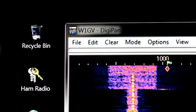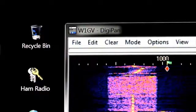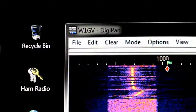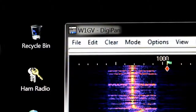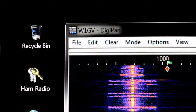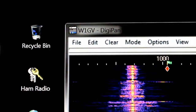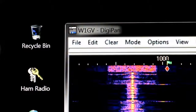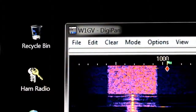There's an awful lot of noise on this band, which is kind of good for this display, because it clearly shows the passband for you, as well as the signal. Now we're down to a 250 hertz wide filter. Now we're down to only 100 hertz wide. I want to make sure always to center the signal at the center of the passband — and that's generally about 680 hertz, which is a pitch that I like.